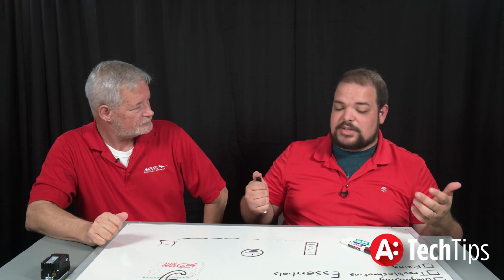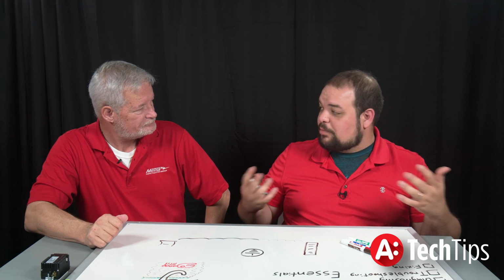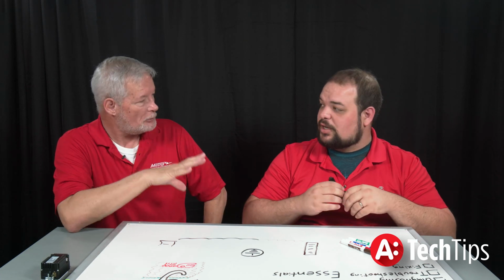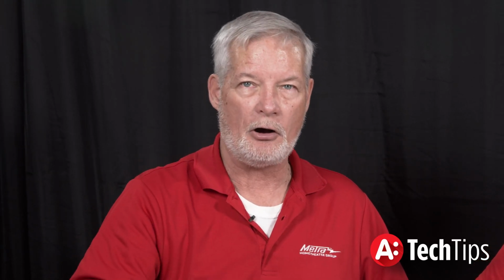And actually, a lot of times the higher-end devices, like Blu-ray players, will have a three-prong plug, and that's good to have. But even some of those will have a grounding pin on the actual back of the chassis. So use it. Anytime you can, make sure it's got good grounding. When you look at coax, HDMI, and network connections, inside of the device they all share the same grounding backplane.